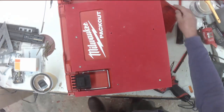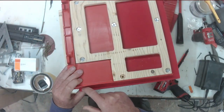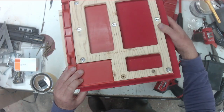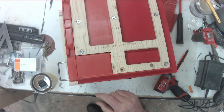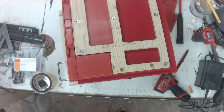So that made me think, well, maybe that's what I can do, is weld a little tab of polypropylene right here and have some plastic screws that I used on another aspect of my toolboxes. They're very small, very short, but I should be able to screw that into the back of the HDPE and just make that section a little bit stronger. So if it gets caught on something, it's not going to bend the plastic, rip it off of there, whatnot.